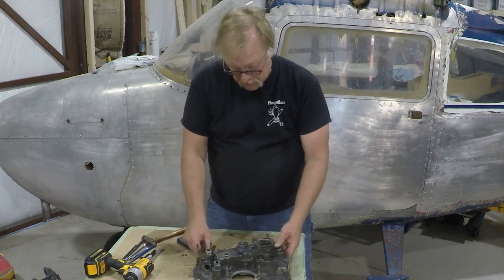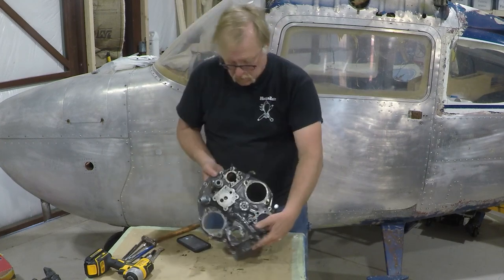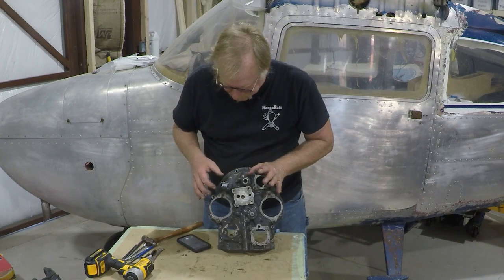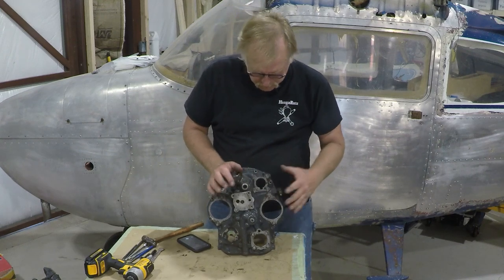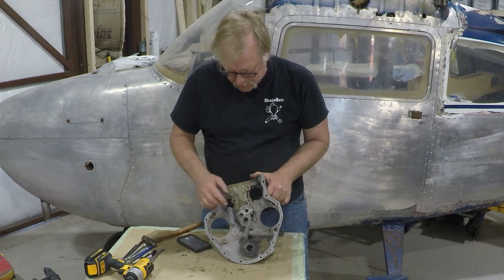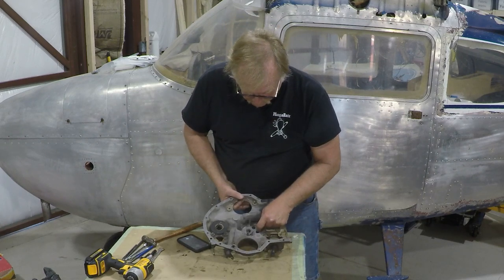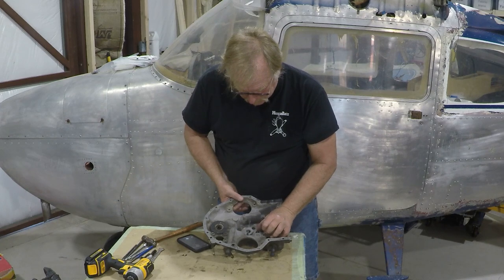This is an oil pressure fitting. This is a breather line, case breather. Oil pressure fitting, this goes to your, I don't know if that's a propeller, I don't think it's the governor line. That's another line there, but this probably goes to the oil cooler. There's also a seal in here. They'll take that out, so I'll just leave that be. I'm not going to worry about the gaskets when they tank it. They'll clean that. They'll take these three studs out and then resurface where the oil pump is and all that. So that's cool. Everything's looking good there. This actually doesn't look bad. There's a little debris, but not too bad. I'd say 1 to 2 thousandths, maybe.